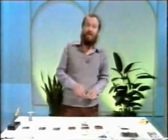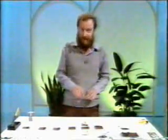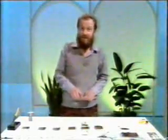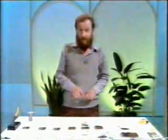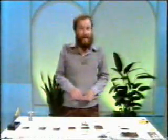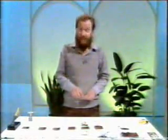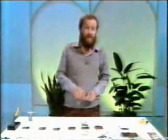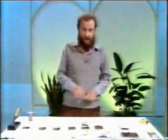For the Commodore 64 and BBC Micro, there are just 11 electrical components in the receiver. For the 48K Spectrum, some additional components are necessary because it doesn't have a user port. And there it is. Whatever your micro, these components are all readily available from organisations like Maplin's Electronics or your local Tandy store, and the total cost is about £4 for BBC, £5 for Commodore 64 and £8 for Spectrum 48K. The most expensive single item being the plug connecting the receiver to the micro. Personal Computer World magazine contains the list of parts for your micro, the circuit diagram and a set of instructions.